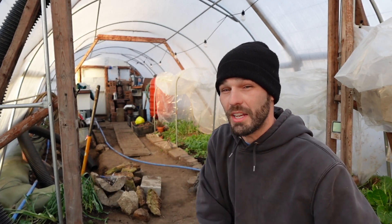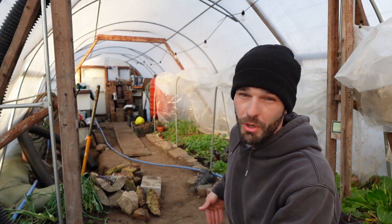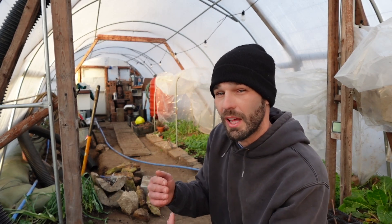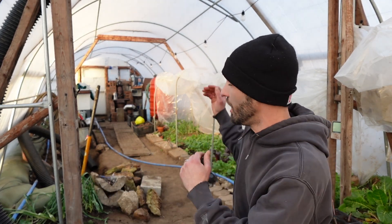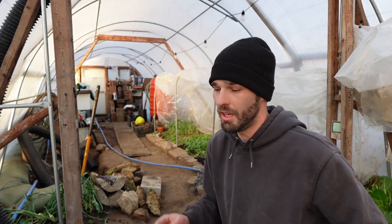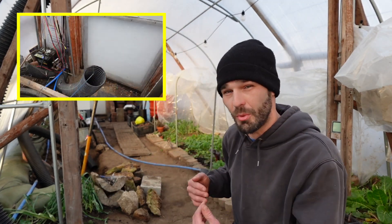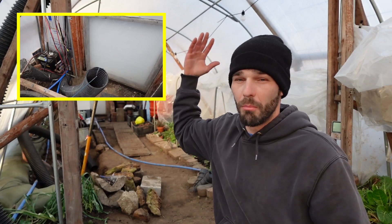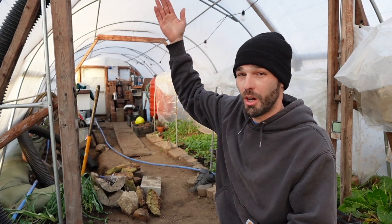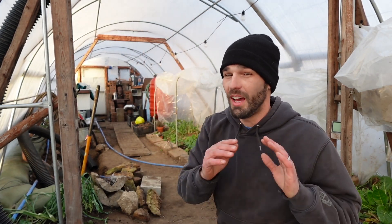On cloudy days we are putting geothermal to the floor, we are pumping compost heat in — even on a super cloudy day we're pulsing that energy, pushing heat through the compost and blowing it back in here at about 80 to 100 degrees. We're putting that in and it rises right up because it's not directed into a tunnel or at the ground — it's just blowing all over the greenhouse. As it fills up, it's going to come and approach the middle of the greenhouse and we're going to be able to draw that down on a cloudy day.